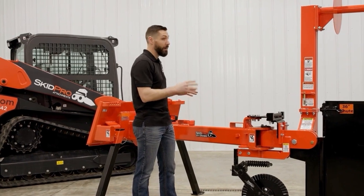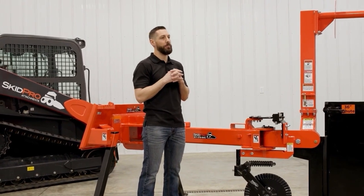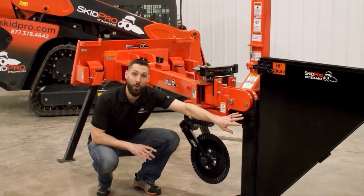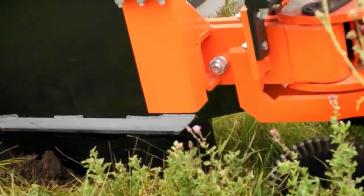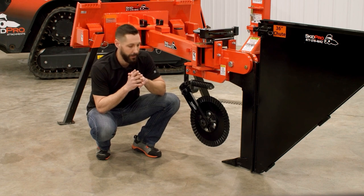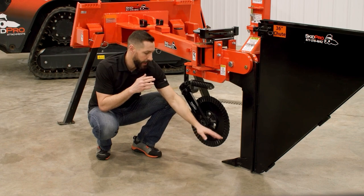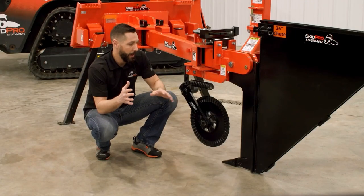You will see, particularly on the push-pull design, why it's so important to have that strong skeletal. Let's take a look at the critical ground-engaging points. First, you have the moldboard knife into the plow point. The plow point is an extra-large 2 inches. It's made of high-carbon steel and it's hard-surfaced — incredibly durable and abrasion-resistant. It's also pin-on replaceable. It's designed at the exact angle to disrupt the soil upwards, which is going to reduce friction and allow for easier pulling.